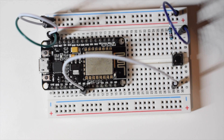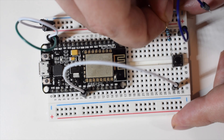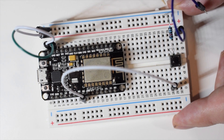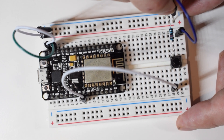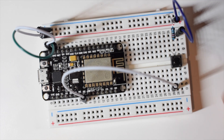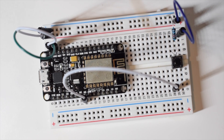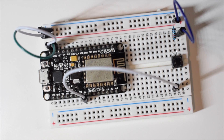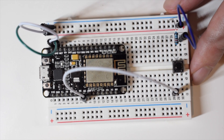To do that, I disconnect the resistor from plus and connect it to ground instead. Now we have the resistor connected to ground, and this wire connected to plus where VIN supplies electricity. So with this design we have a pull-down resistor. The initial state for D5 in input mode is going to be LOW, and when I press the button it should change to HIGH.